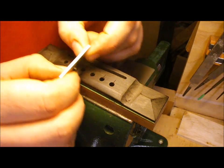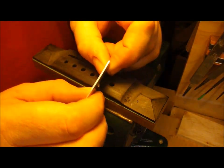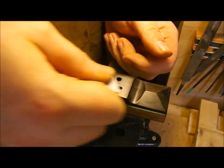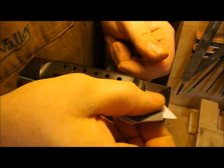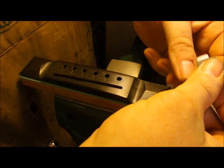I'll use a scraper to refine the shape, add some radiuses and some curves and lend it some sex appeal. And then after that it's just a whole lot of sanding, ending up with this. This is micro mesh abrasive pad, and this ebony is so close grained that when you get up into the six or eight thousand grit range it almost looks like it's got a finish on it already.